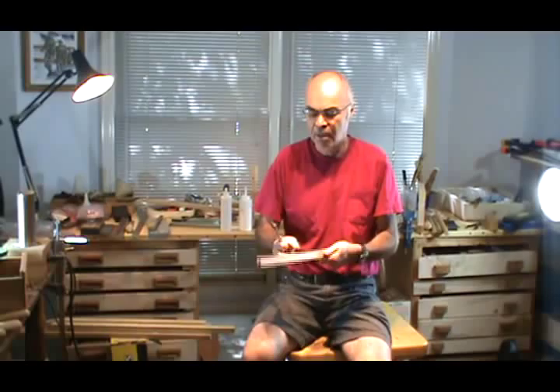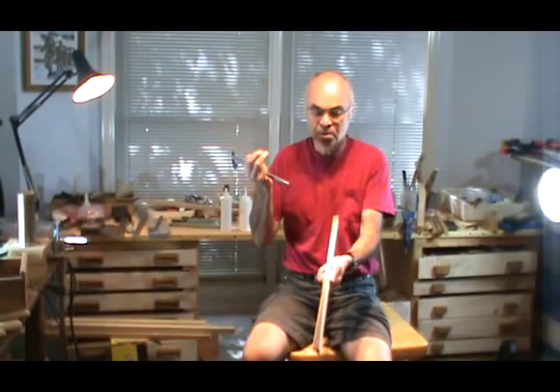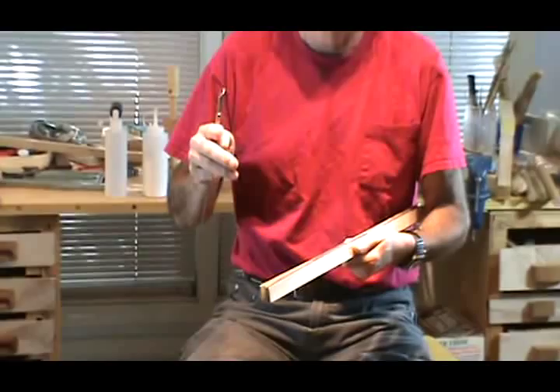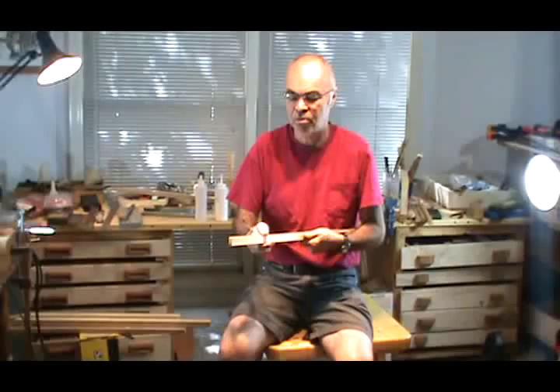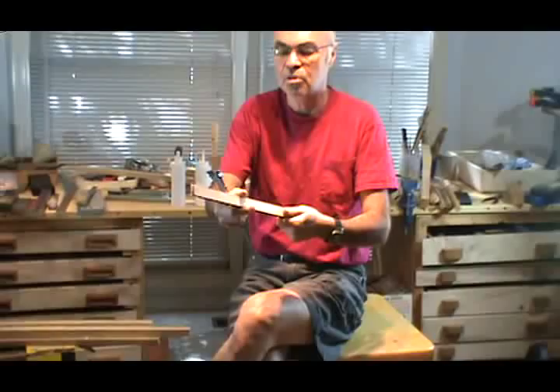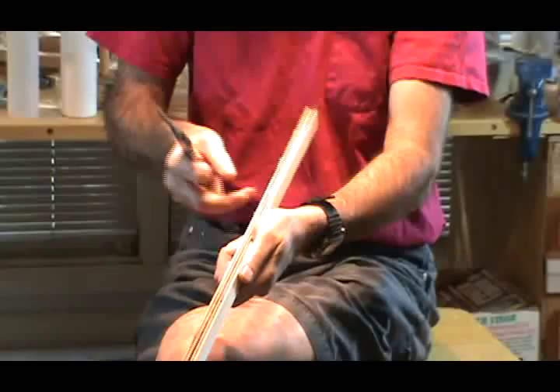I generally use what's on stock or what's left over in the shop. In this tutorial I've used two main woods — maple and walnut — for the contrasting colors. This design could be used for your headstock, for your butt inlay, on the back, anywhere that you'd like to put a little inlay. It's not that hard to do. Basically it's just seven veneers of a thin hardwood, all laminated together in a jig, and then once it's all glued up, you can further refine the inlay by cutting it down to the size you want on the bandsaw.